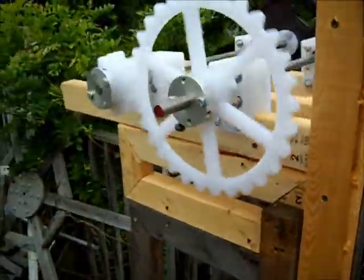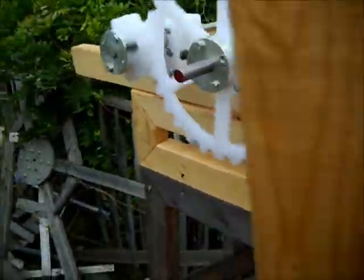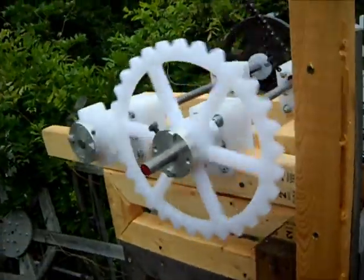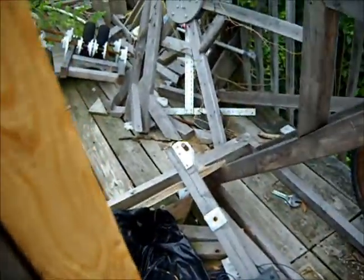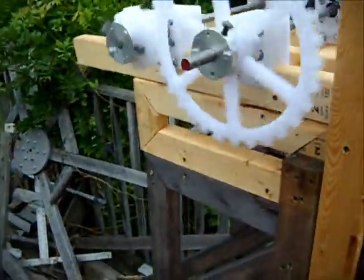The other problem is I'm not sure the magnet and solenoid configuration will produce enough force to keep the pendulum moving. I'm thinking at this point to go with a two-coil configuration — one at each end of the swing — so I get a push on each side.